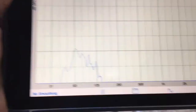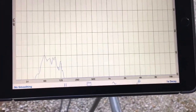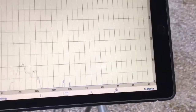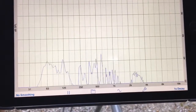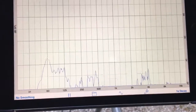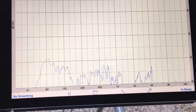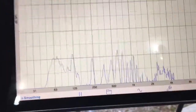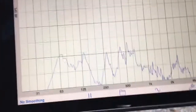I've got my real-time analyzer on the iPad here, so I'll just walk around. Right here we're at about the 40 dB line on the low end — it's just running pink noise from the dbx PA2 processor. Now I'll walk around the speakers in about a 20-foot circle.